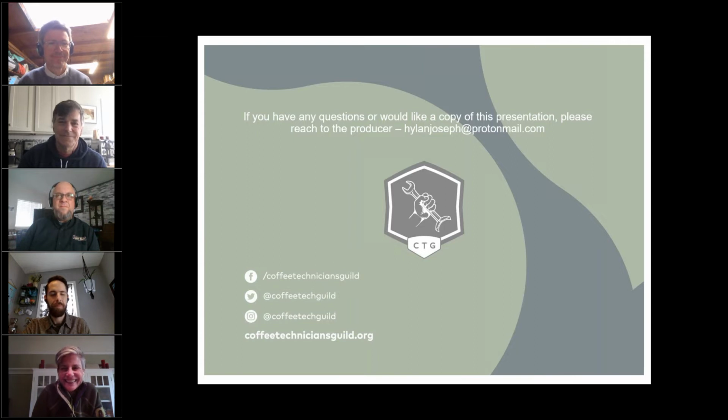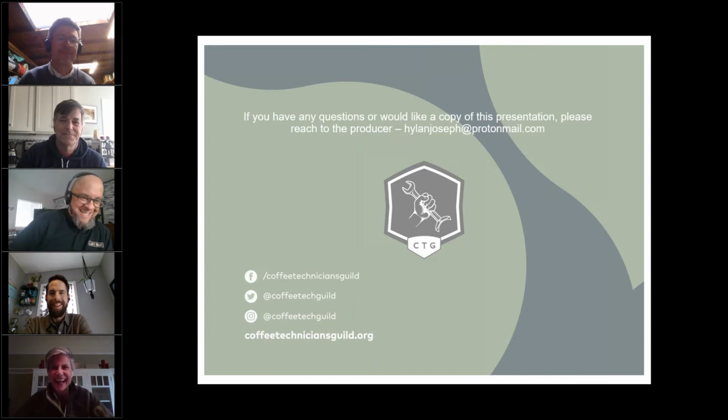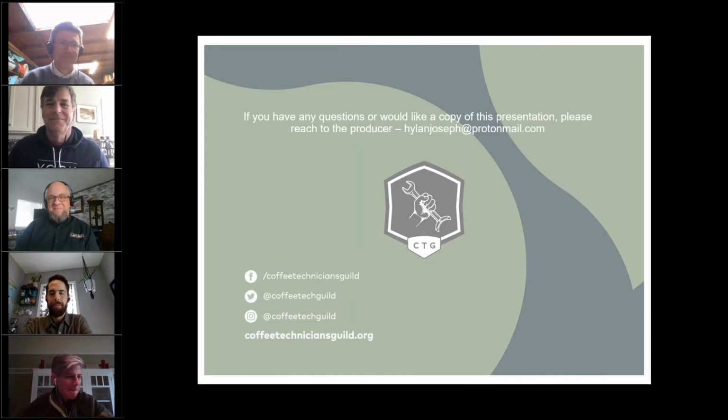Kurt, how about you? First thing, thank you to Arno, David, and Candace for coming together for this. But I do want to point out from the standpoint of a service tech company and a tech, if you're willing to take on roasters, make sure you understand your roasting customers are emergency customers. Don't take these on if you're not willing to show up within hours, because they will be choking you. They will show up at your house, in the middle of the night. I don't even care. So I just wanted to point that out. Don't take on roasters unless you're willing to dedicate the time to it.